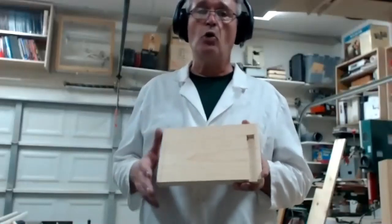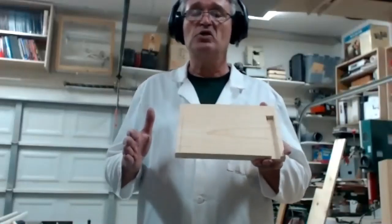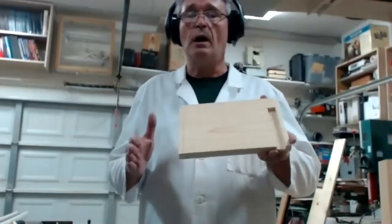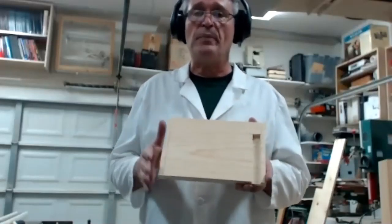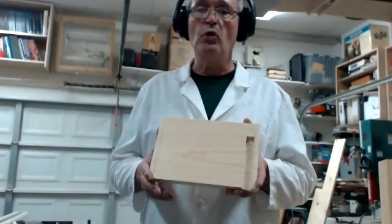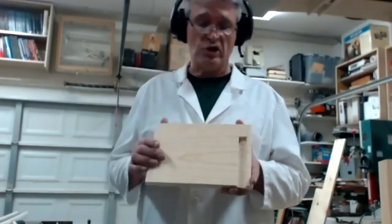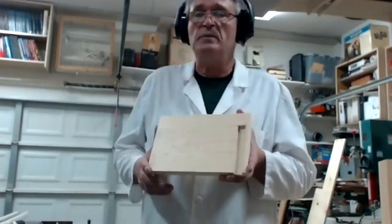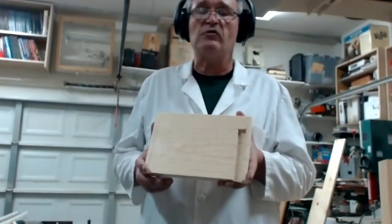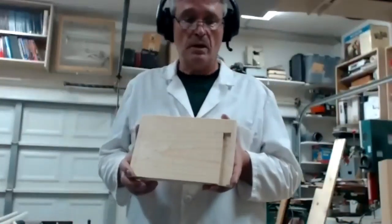So it's going to hold up a lot of the structural tweaking or racking of the two side panels in order to keep the face frame true and the door true when we go to hang the door. That's a great question, though. Some dados, you only have to make maybe 1/8 or 1/4 inch.